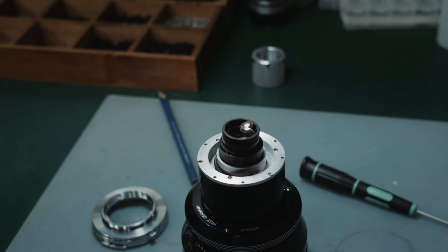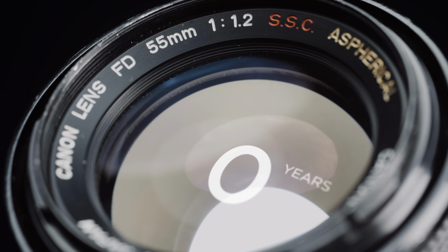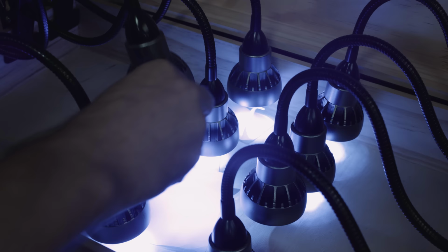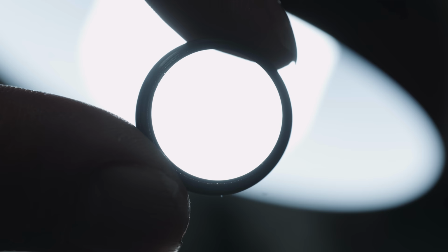Radiation of thorium inside a lens element can cause a crystallographic defect called F-center. The glass turns more and more yellow over decades, acting like a filter. Besides the shift in color, the transmission gets reduced. Just like rust on a classic car, this is not considered a vintage characteristic. The effect is completely reversible by exposing the lens element to UV light. And no, the radiation is not dangerous to you unless you grind and eat the lens.